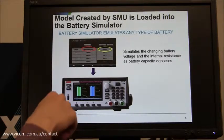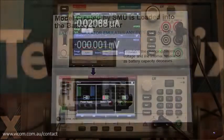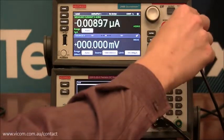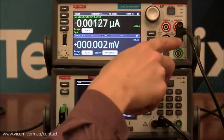You're going to insert a USB flash drive in the 2281 and import that model. For this demo, you're going to need to connect your 2281 to your 2450, 60, or 61 — high terminal to high terminal and low terminal to low terminal.